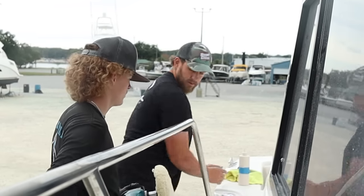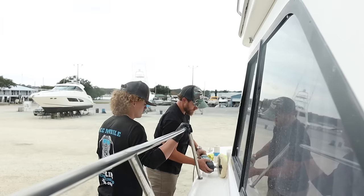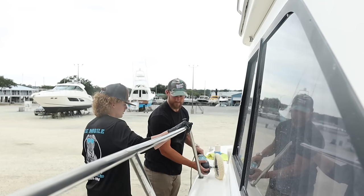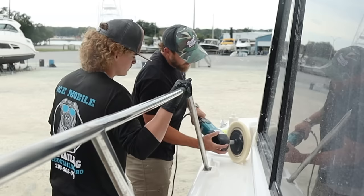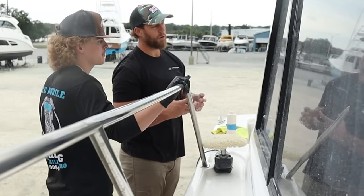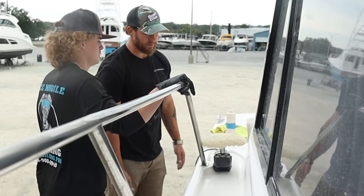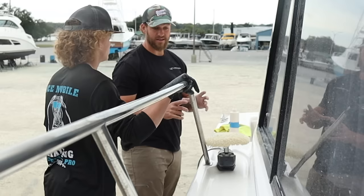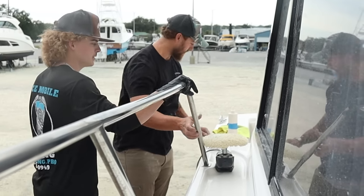This is heavy cut right now. On the Makita I want to say I was around 1700 RPM to really cook it in — three and a half is about 1700, good guess. When you're working, really put a lot of pressure and move as slowly as I'm showing you. The gel coat still has pretty open pores from how old it is, so letting it heat up and really polish out will brighten up the surface the best we can. Get a good section done, wipe it down, check for sanding scratches — use a headlamp and make sure your speed and pressure are enough to remove them before you do the whole side.